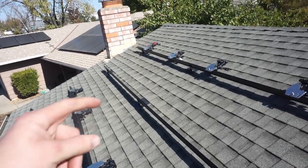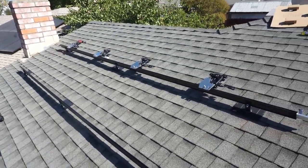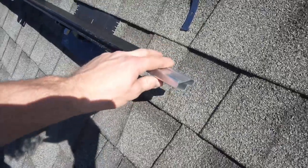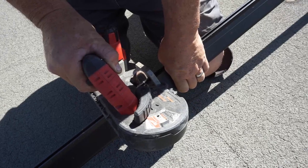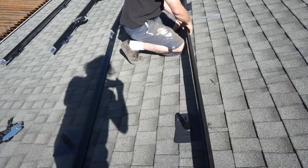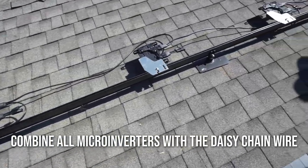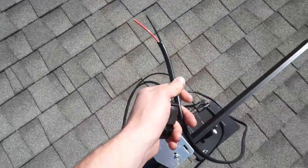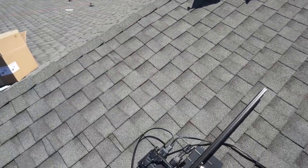The full run of railing spans 20 feet, but the railing sections we have are 14 feet each. So we have these couplings that go between them and we stitch on an extra piece to the end. Here's our first string - it runs from the bottom set up to the end of the top set. There's the end of it, which will go to a J-box and get run off the roof to the combiner box.